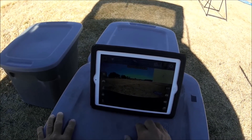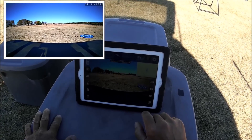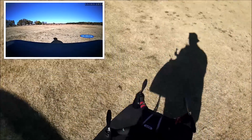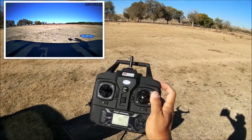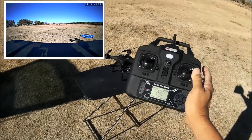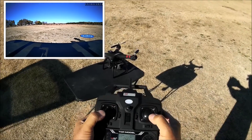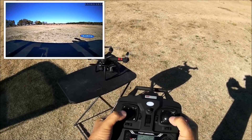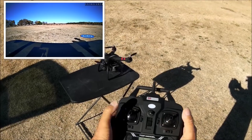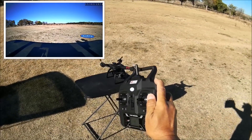We hit play and we have FPV. I'm going to record video since I don't have screen record on this iPad. What we're going to check out is whether the one-key takeoff and one-key land work, the return-to-home function, the fail-safe return to home, and if we have enough time, the low voltage return-to-home phase one and phase two where the 30-meter geo-fencing gets activated.